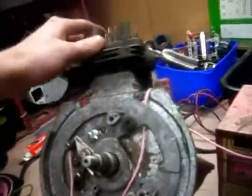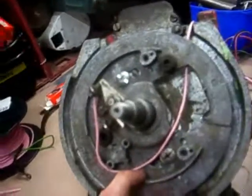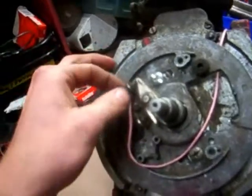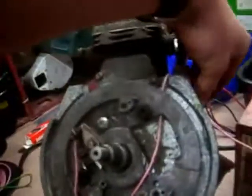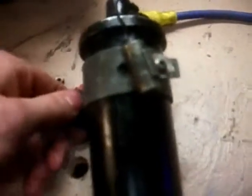There are many reasons why you might want to do that. One of them might be, as in this case, the coil's rooted and it's going to cost me 80 bucks to rewind one. I don't really want to rewind one because I don't have any use for the engine — I just want to run it. So basically all you need is a standard car coil with a condenser attached.